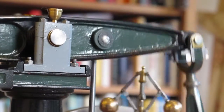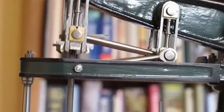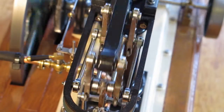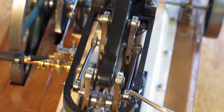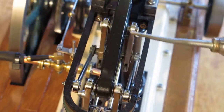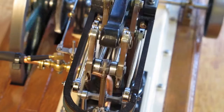One of the biggest errors I found was that the clearance on the parallel motion is inadequate. This is the parallel motion in action, and the clearance here and here is inadequate if you follow the drawings — they actually clash. I simply reduced the size of the bosses on the various components to give sufficient clearance, and it then seems to work quite nicely.